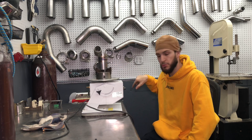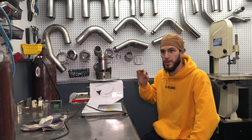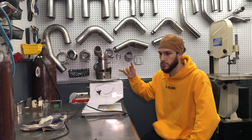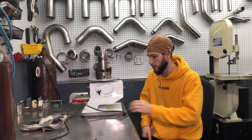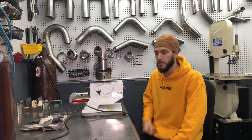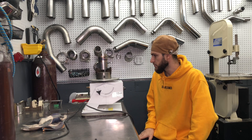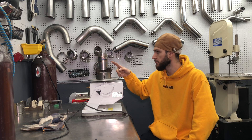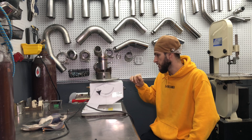These are the settings I'm going to show you. We're going to do pulse with these settings — you can get full penetration on stainless. If you purge it and get full penetration, it'll be quite strong, so you can get away with exhaust and stuff like that. You can add filler if you want, just dial back the pulse rate. It's .065 stainless 304, and I'll show you the parameters I like the most for this material.